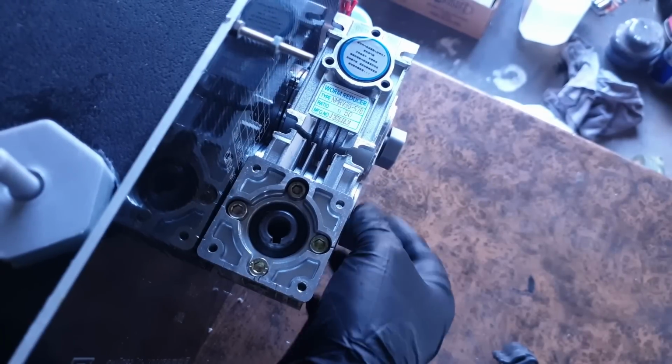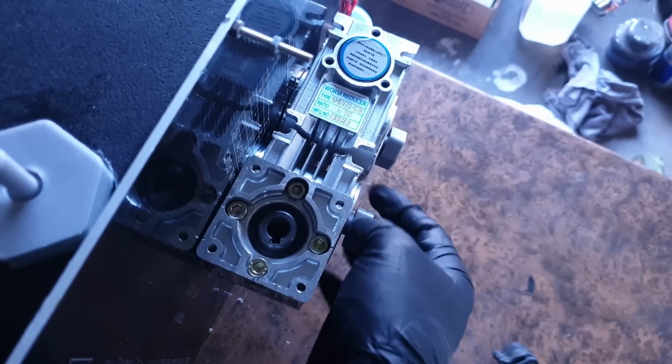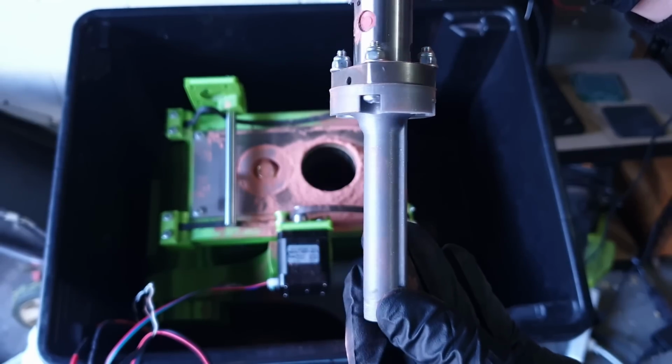Furthermore, the use of 3D printed parts is too much of a compromise, and I've also been told that cheaper ball screws can suffer from tolerances bad enough to cause these problems. From the beginning I've wanted to keep this as cost effective and DIY friendly as possible, but it seems that this is going to need an all metal assembly.